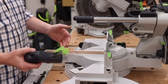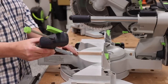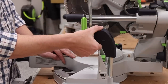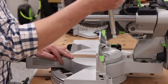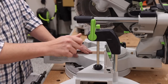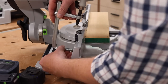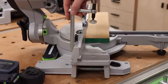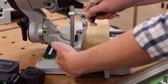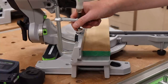There's a difference in clamping options between the two. The KS120 comes with a large clamp — you insert it backwards into the slot, spin it around so it can't come out, and there are spots on both the left and right. You simply push down to lock it in place. The KSC60 comes with a standard screw-style clamp, with slots on both the back and the front for clamping on either side. With this style, you can move up and down very quickly, then twist and lock it down. When done, slide it out of the way.